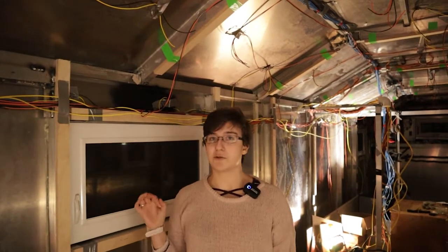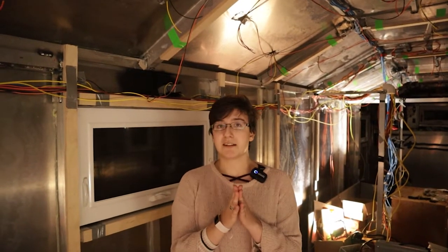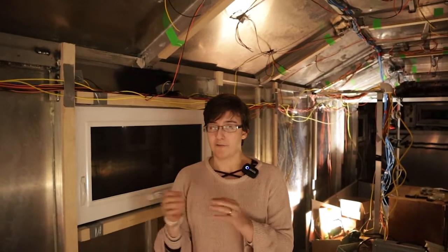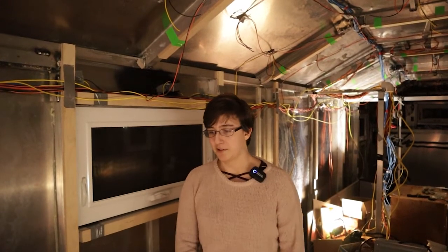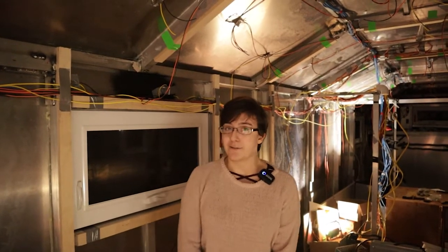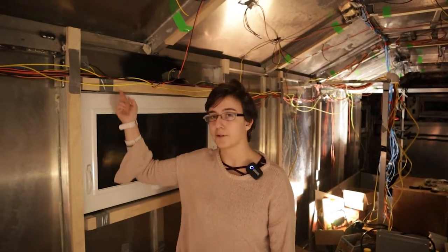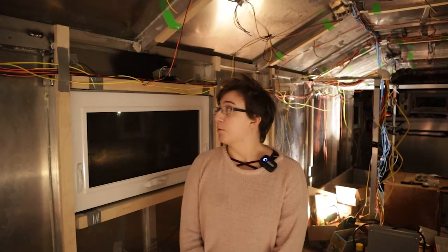The longer it goes, the thicker the wire, the less voltage leaks, but that's also why you can't run data cable with power cable, because of the voltage leak off from the other cables, the power cables. It interferes with the delicate data transfer of the cat cables. So we did run these 10 gauge wires for the things that needed more power, things that consumed more power. So pretty much everything that moves or makes heat or cools down, we're putting 10 gauge instead of 16.